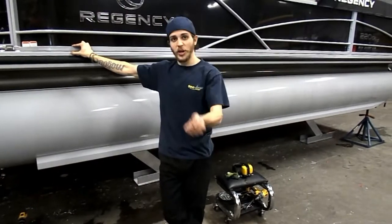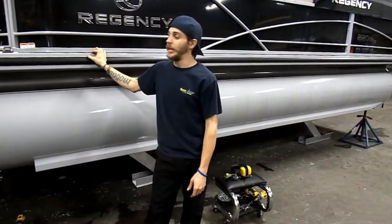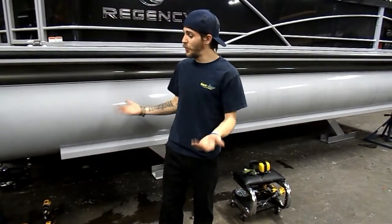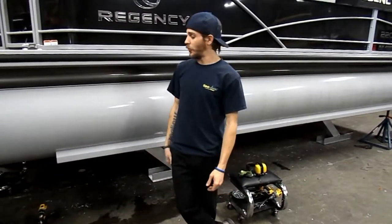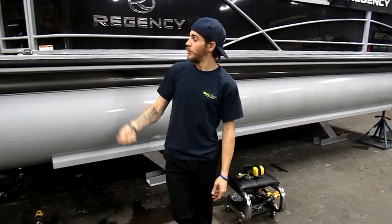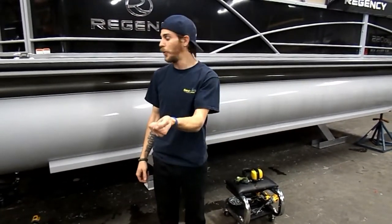We've got our four legs up and mounted, hoses connected, and tightened down the fittings. It's bleeding time. I'm going to add oil into my pump, retracting the legs until I get them all the way retracted up to the boat. It's going to take about two gallons, maybe a little more. Then I will extend all four legs, raise the boat up until it's barely off my two-foot stands - front and back just a little clearance - then set it all the way back down and retract those legs. You'll get a little air kickback. Keep filling your reservoir as you're watching it. Then I will go all the way up from full down, and you'll hit a spot where your motor starts to labor - it'll wind really high, high-pitched noise - that's when you know you hit an air pocket. You just do front down, retract on the front, and it'll suck those air bubbles right out. You'll hear them go, then continue to go full bleed up until the boat is fully bled.